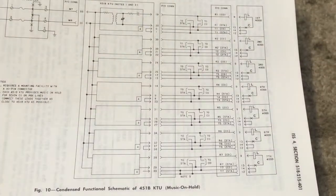The Western Electric cards require a 40-pin socket, such as a 642 panel, as well as several other types of adjunct panels that had 40-pin sockets cabled out to a 66 block for cross-connecting. The ITT K403 uses a standard 18-pin socket, so if you have an ITT K584C panel you could remove one of the sockets to plug the ITT card in. Or if you have an ITT K601, there's a miscellaneous slot made for a 20-pin circuit that you can use as well.